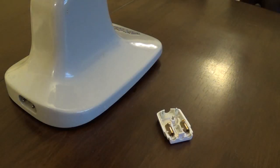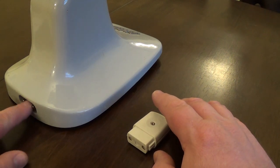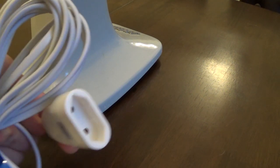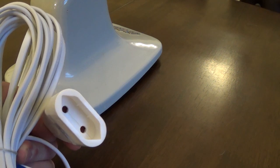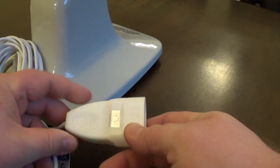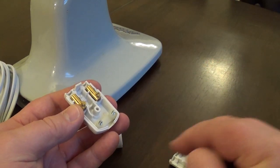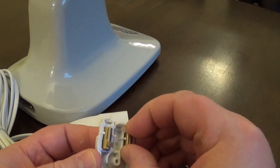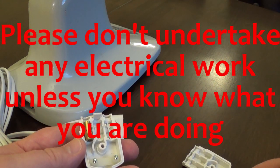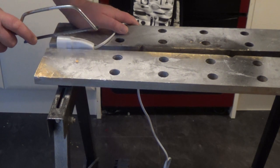I have had a slightly off-the-wall idea. This is the small 10-amp connector that will actually fit in there, but with the pins which are too large. And this is the European thing that Bob suggested. What I'm wondering is, although that is a sealed moulding, if I can carefully cut that open, I wonder if I can transplant the internals from that into the case from this, because they can come out, and perhaps cable and all, fit that together and maybe get something that'll mate. I'm going to try hacksawing along the moulding join and see if that does the trick.